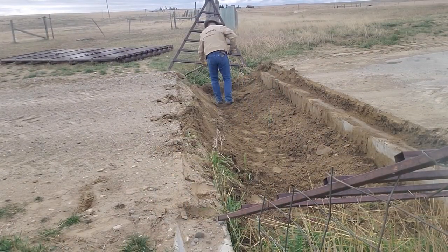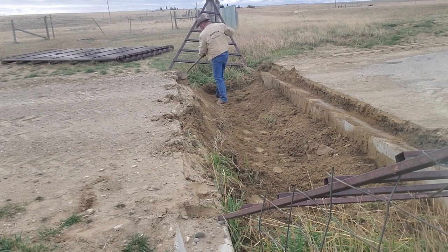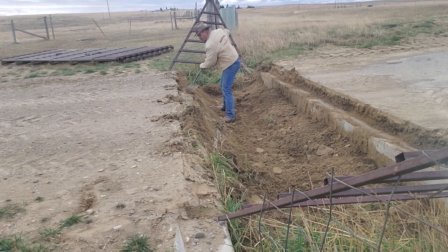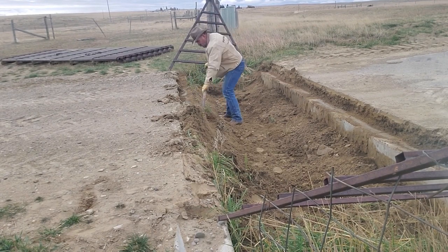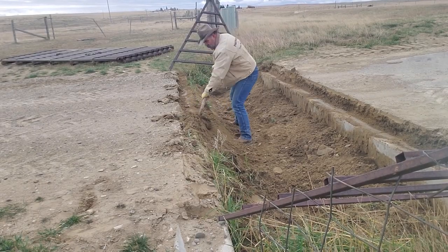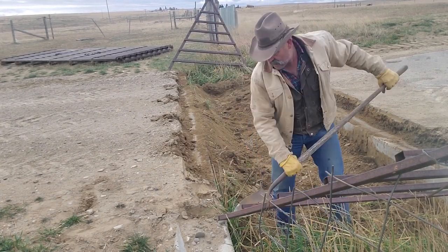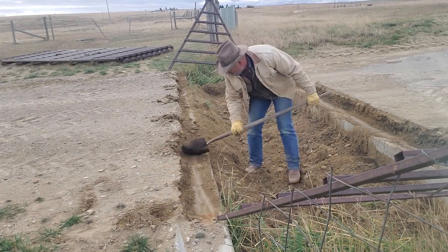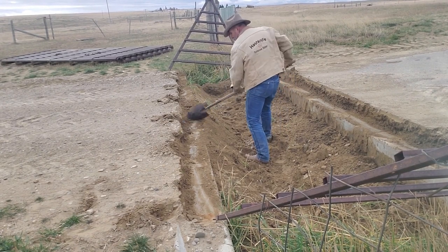You can hear all that wind and scraping — that's why I'm doing a voiceover. He's going through the other side now, and you can see the big difference of all the dirt he's pulling away, clearing that shelf to allow the cattle guard to set in. Same as the other side — he'll chip away the dirt built up on the edge of the concrete, expose that shelf, and flatten out across the bottom to ensure universal depth from one side to the other.